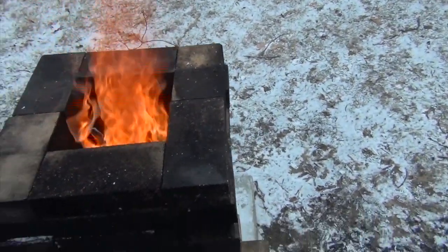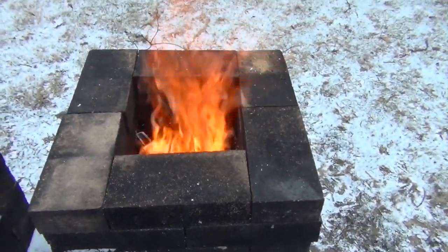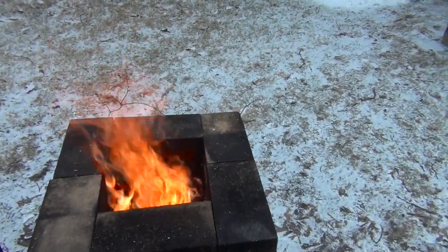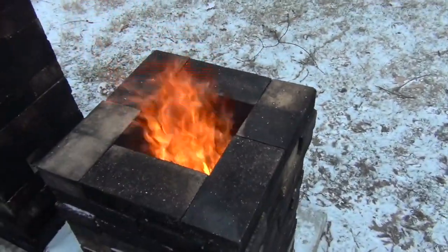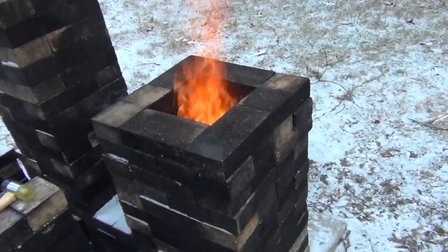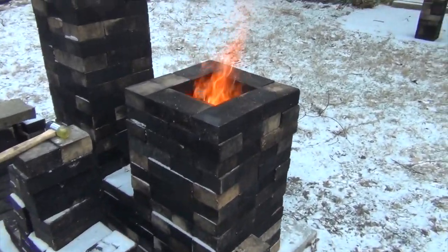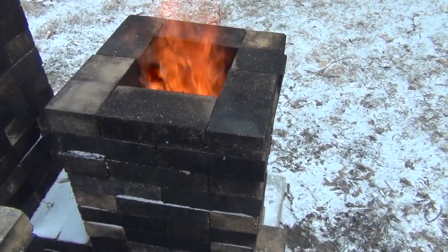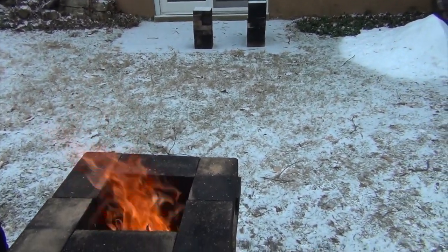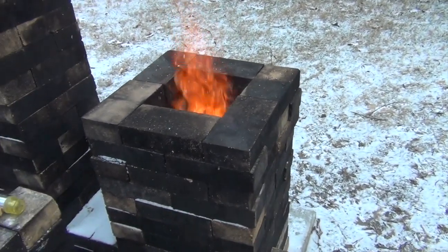You have to be very careful to make sure the draft is moving in the right direction. There's a slight risk of backdraft, and that's a disaster. But once you get everything flowing in the right direction, for me it's just instant. With the 30-foot outside airline, I can absolutely notice the difference with the stove taking the cold air from outside versus stealing the warm air from inside the house. Here it's kind of like an outside airline - it's coming down four feet, across two feet, and in, instead of directly underneath. Mine's 30 feet long, and I'm absolutely thrilled that I rigged up the outside airline. It doesn't take away the performance of the stove at all.